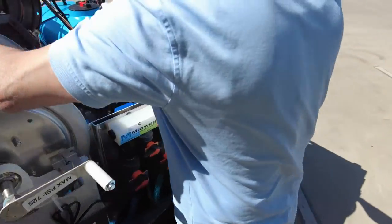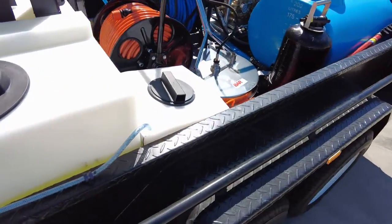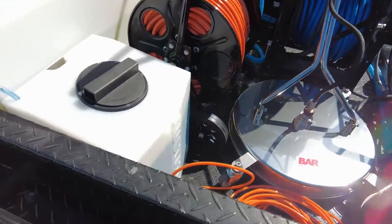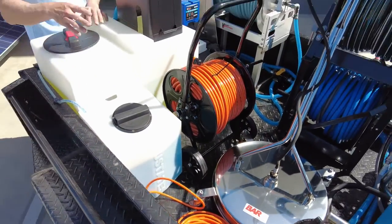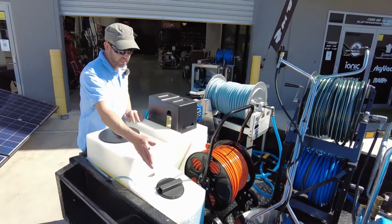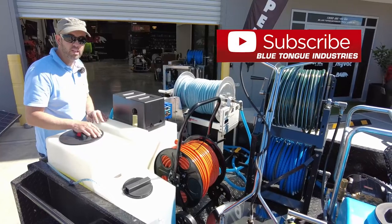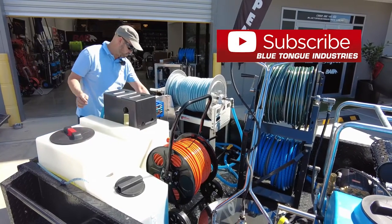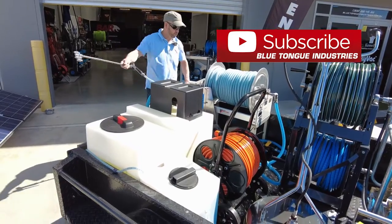Mosmatic 21-inch surface cleaner for those flat surfaces, whether hard or soft. Tucked in the corner here, the one-off 25-litre soap tank, which is all going to be pulled through your proportioner. The pump is going to suck through the proportioner — the metering valves on the front are going to pull the designated selection of soap, SH, and water to allow you to carry out that particular clean.